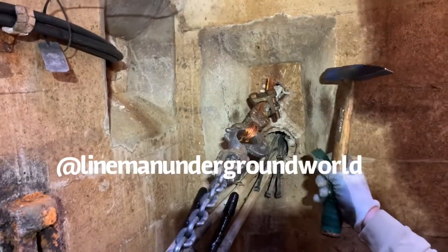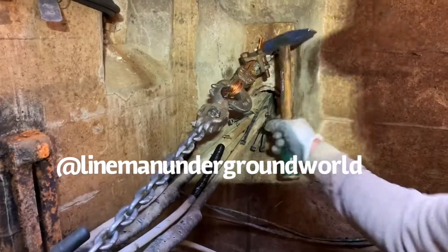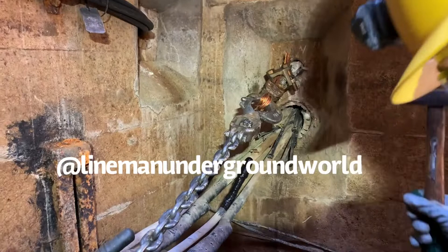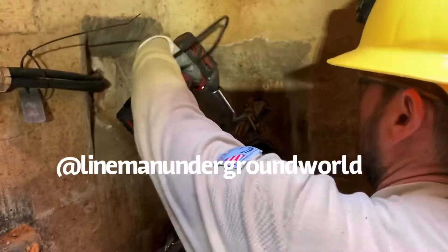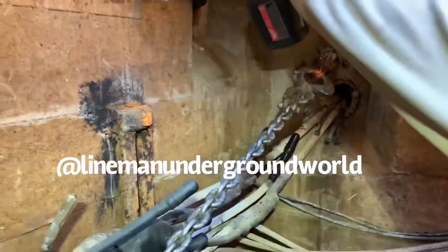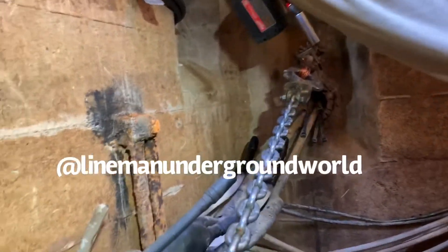Alright, so we're pulling a strain on it, and he did get movement on the other side. But you always got to remember to rig this as well as you can to make sure that lead and the cable don't come apart, and all we get is the cable coming out instead of all of it with the lead. So we're going to rattle that a little bit more. He said he's got movement on the other side, we're going to take it up a couple more and hopefully she'll come out. We're rigging off with the chain hoist — one-ton chain hoist.